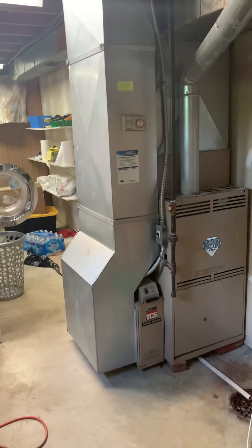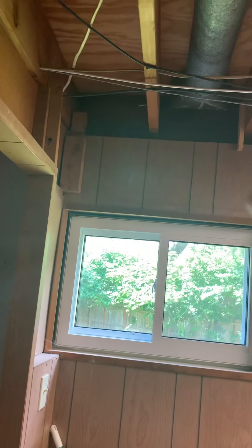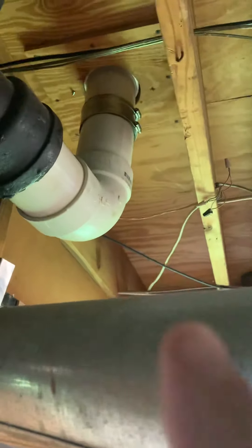With that being gone, that means PVC running out through the side of the home. One really important thing is to keep it tight to the joist as best we can. We want to get with the homeowner to make sure where we go out is okay. We have options throughout this whole wall, but there's a dryer vent here, so the perfect scenario would be right in this area — although that puts us a little close to the dryer vent. Maybe here instead, come back, and where this plumbing is we might drop it down. Let's talk with them and see where our height is on that.